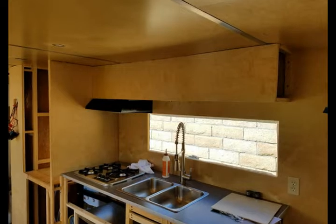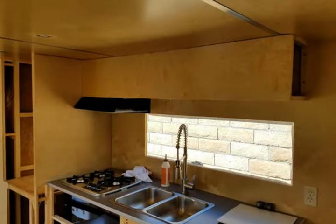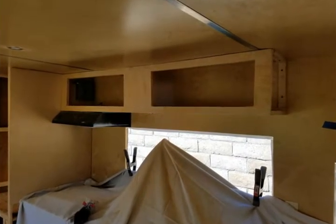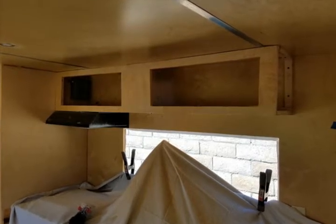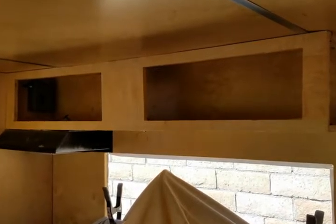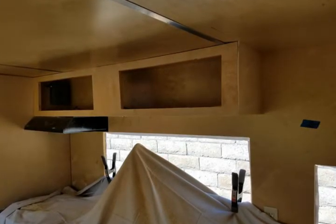Cabinet work — this is the cabinet above the sink and range top. Single sheet, staple in place, drill a hole. There's another look at it. Up on top there's going to be a little molding to make it fit in better, make it look nicer, a little finished look. Once you've drilled those holes, you stick the trim router in there and just follow along the pattern of your opening, and that's what you get — a finished cabinet. Looking very nice. I also finished up the side, so the side is closed up as well.